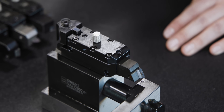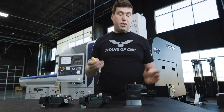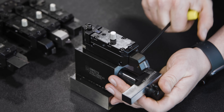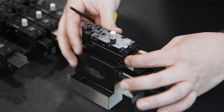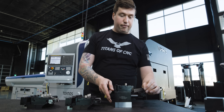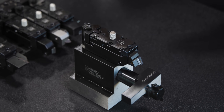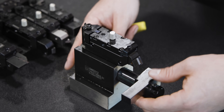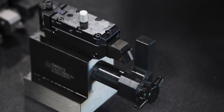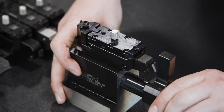You just throw your holder in there, lock it down, tighten it down for good measure. I'm going to break these guys loose — there are screws on the top as well — and take your tool out. You walk to your toolbox, grab your new tool, come back, and throw it in. But if you put this in like this, you'll have to touch it off in the machine. Golden Bolt has a nice little tool pre-setter where you can just flip it up, tighten it down. If you touch all your tools off like this, they'll be right. Snug everything up and now your tool is touched off.